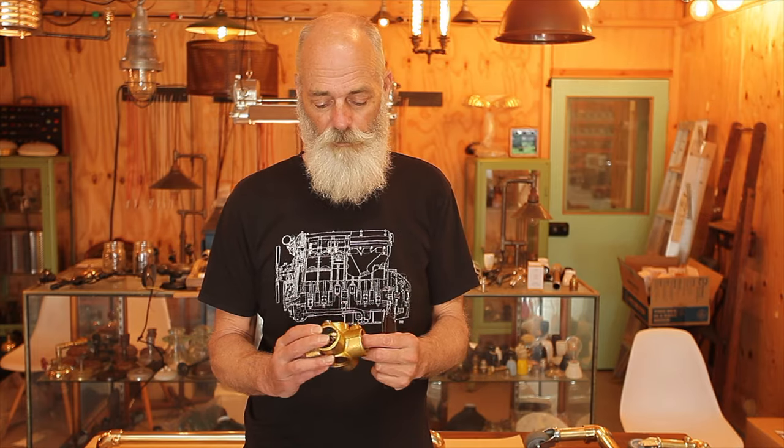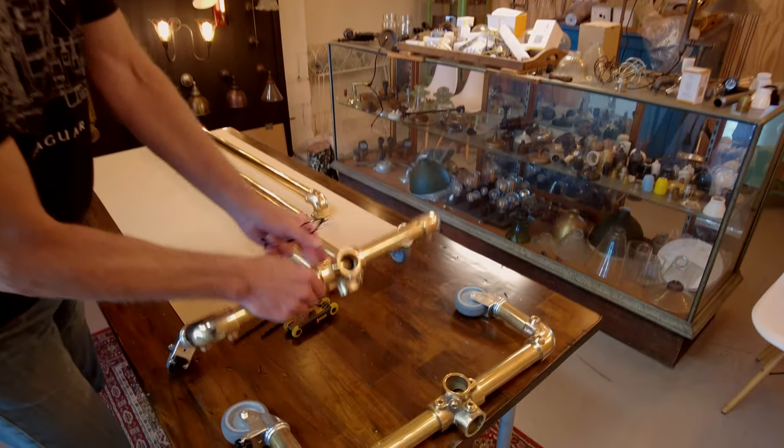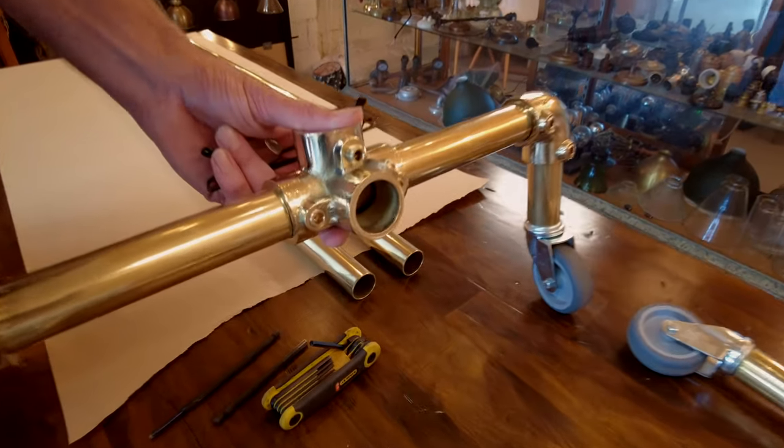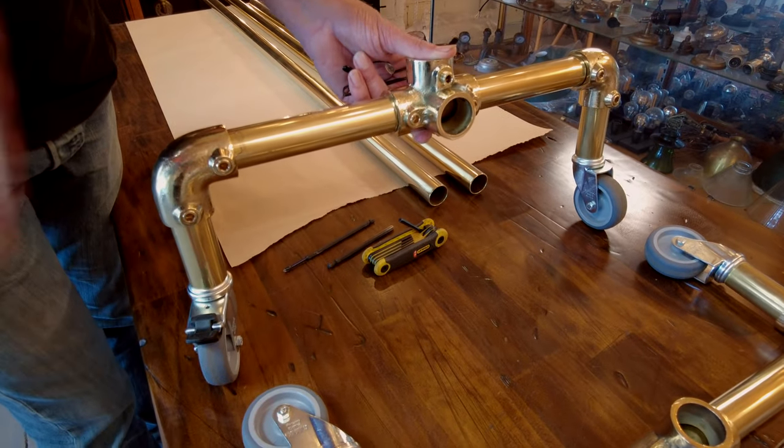While that brass colour looked good and we did a few products, we decided that because they didn't quite match and wouldn't age the same — and you couldn't polish them — we'd send off a couple of fittings to be cast in brass. It's something we've done in the past through Edison Light Globes with our manufacturing partners. We had a crack, cast a couple of fittings for the dress rack trolley, and now they're back. Here is the first dress rack fully assembled, and you can see the brass fittings match the brass pipe really well. They'll age the same and can be polished and cleaned exactly the same.